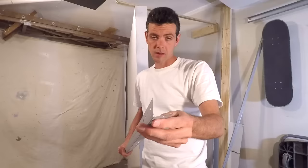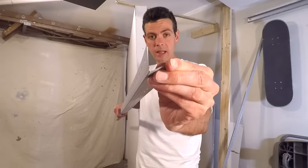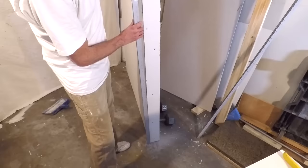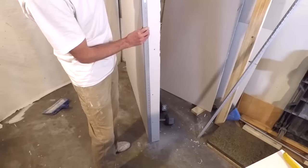The next thing I always look for is after it's cut, it usually bends it, and so I will bend it back in a little bit, depending on which way it needs to be bent. However, because we're nailing these on, that's actually less important. You can usually fix it with a nail. Whereas with paper beads, I always bend that because otherwise that part will stick out, making you need to build it out more. It's a good idea when installing beads to make sure that it's not pressed against the floor. You don't want it tight against the floor. You want to leave about 3/4 inch of room at the bottom for the house to settle.